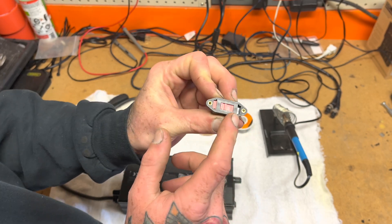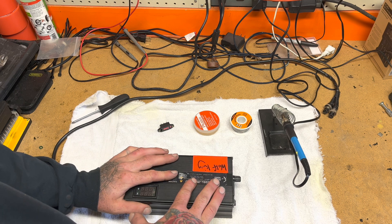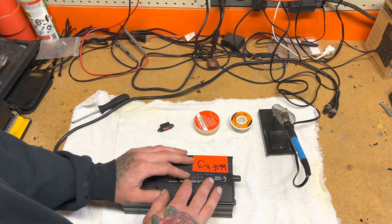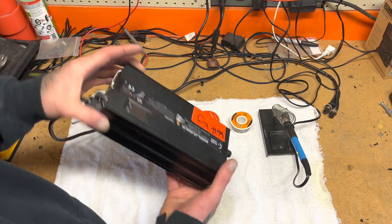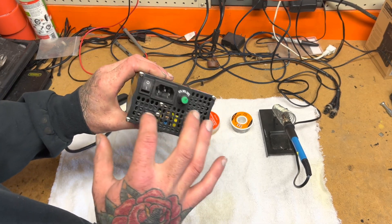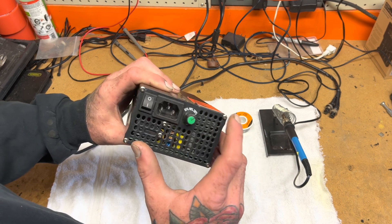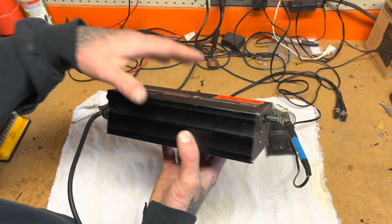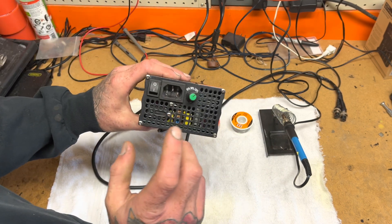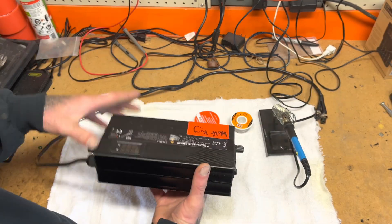This one I got off Amazon — I'll put the link in the description. The charger was just showing 78 volts, and when I played around with it a little bit and held it to one side it would bump up to 84. So I have it kind of taped to one side for now, but I'm going to remove the Phillips screws on both sides of the charger, open it up, and replace the 220 to 110 switch today. Let's get started.